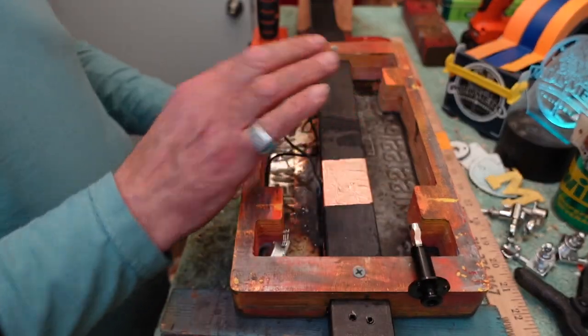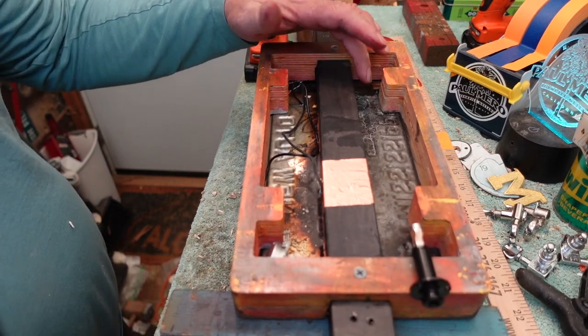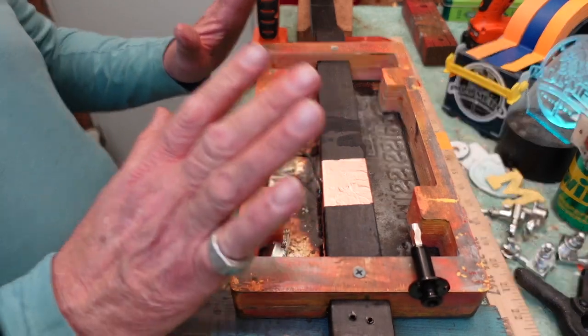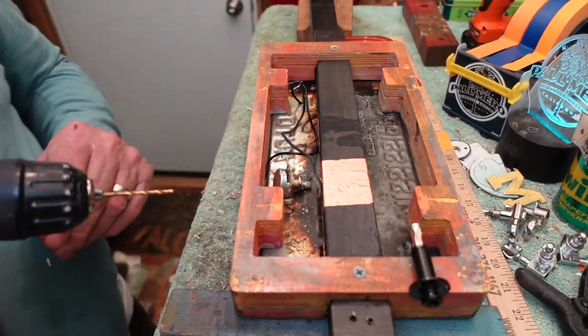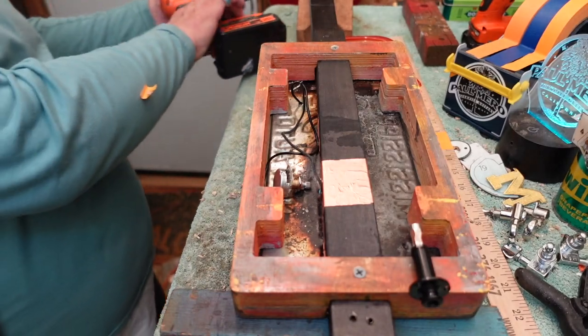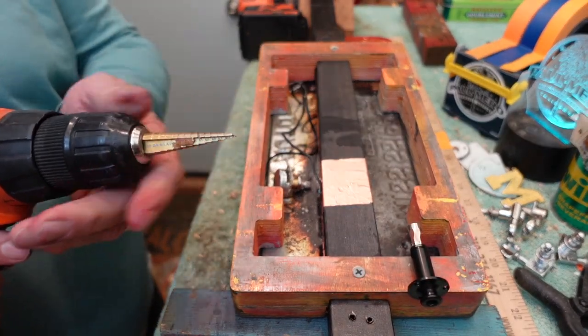We're going to wire the jack up to everything and ground everything. The pickup wire is going to come through here. We're going to show you a little trick with a grommet so that doesn't ground itself out with a piece of wood. Now, when you are drilling, especially through metal, always get a pilot hole where you want, like there, and then, especially through metal, one of these graduated bits works out really well.